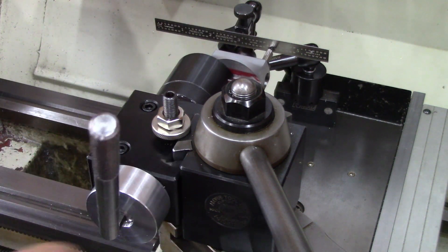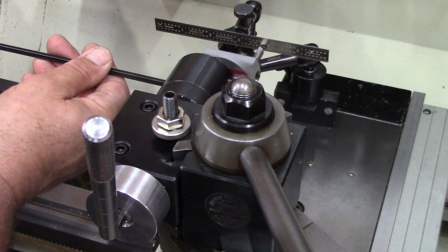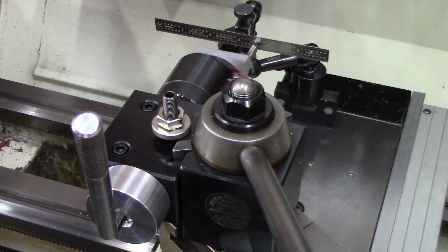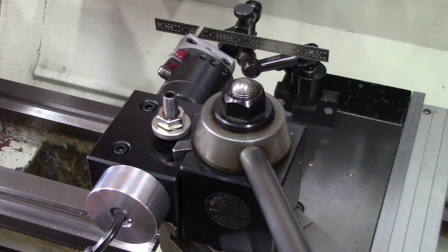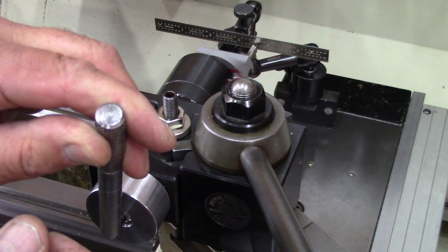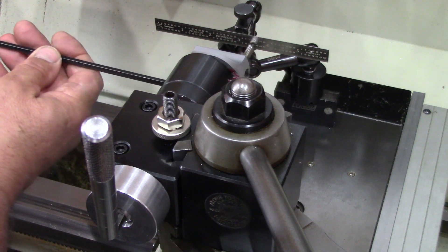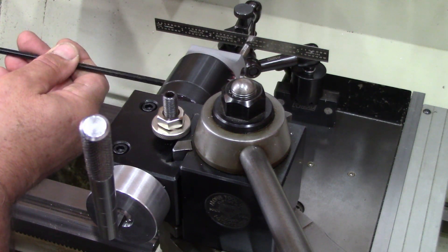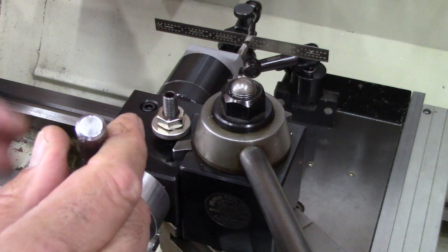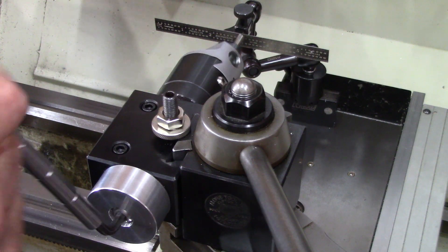As you come in — let's go about a half inch in for demonstration purposes — there's about a half inch right there, and we sweep. As you can see, the size of the ball radius reduces. With the tool on the outside in this slot, we're about 3 and a quarter roughly. So we're going to do about a one inch radius with it like this.